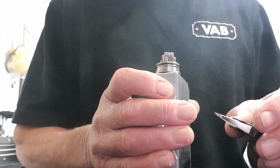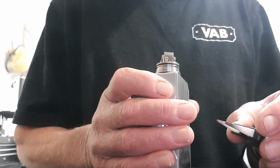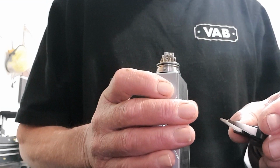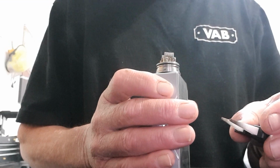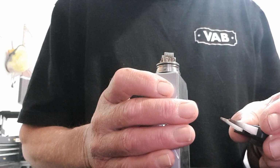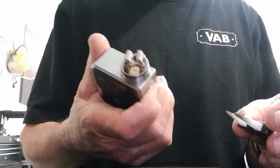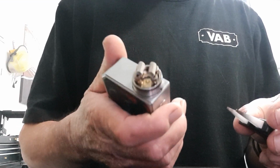Now what I'm doing here, while I'm pulsing so low, is also warming the wire up, because as you gradually increase the watts and the heat, it will actually temper or harden the wire, which makes it better. If you just hit it at 90 or 100 watts, you're going to do damage to the wire because it's cold. So what I'm doing now is just checking for any hot spots inside. And you check your display, make sure that's still the same, which it is.